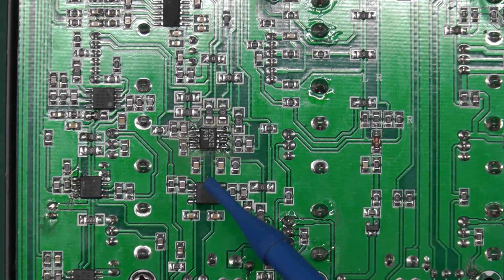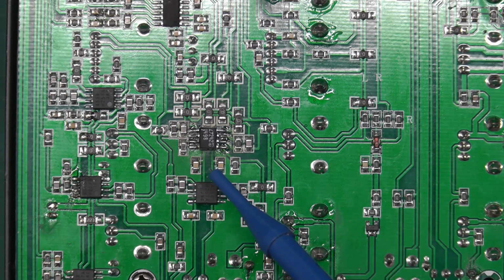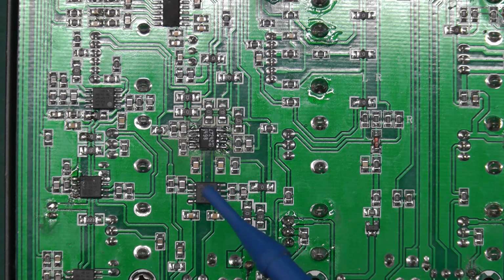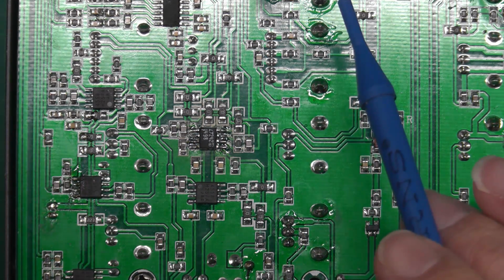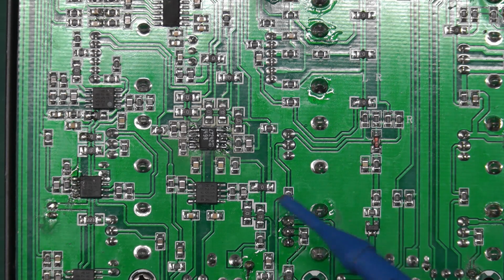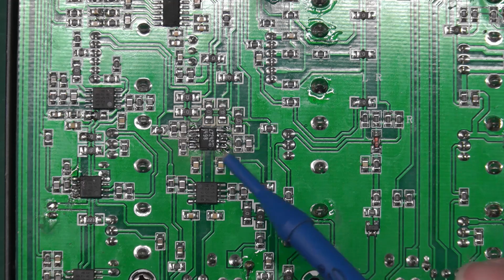And yeah, I had a closer look at that gunk that was underneath the IC, and it was definitely glue. So all of these packages were definitely glued down in place. It's probably why I struggled a little bit to get the IC off there. I was heating it up enough, it just wasn't popping off. So that'll be the answer. So I'll take a quick look over some of the joints on this PCB and touch them up as necessary. Then I'll set it up again and we'll get power into it.